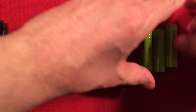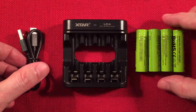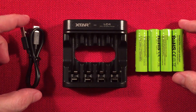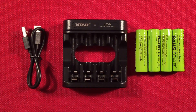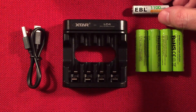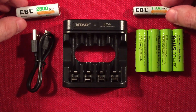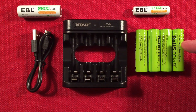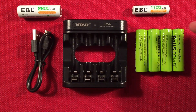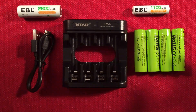It's a good deal if you're not using them for radios. If you're using them with flashlights and all the devices I showed you, it's a good setup — totally worth it so far. I haven't charged these 1,500 times, so I have no idea about longevity. But I like lithium technology; I think it's going to last. I do like nickel metal hydride batteries — there's always a place for them, and a lot of flashlights utilize them properly. The 1.5 volts is better than the 1.2 volts standard of the nickel metal hydrides. In older devices like Game Boys, these will shine.